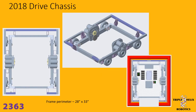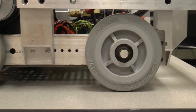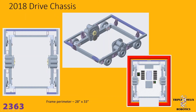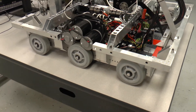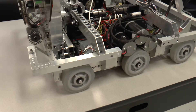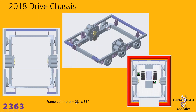What we ended up doing was making some minor modifications for the 2018 game: we went from four-inch wheels to five-inch wheels to increase the ground clearance, and we added an outside frame perimeter that bumped the interior dimensions of the robot larger so we could fit more stuff inside, with the frame perimeter now being 28 inches wide by 33 inches long — the maximum that was allowed.